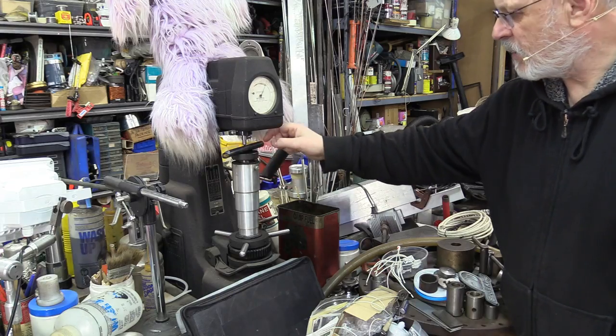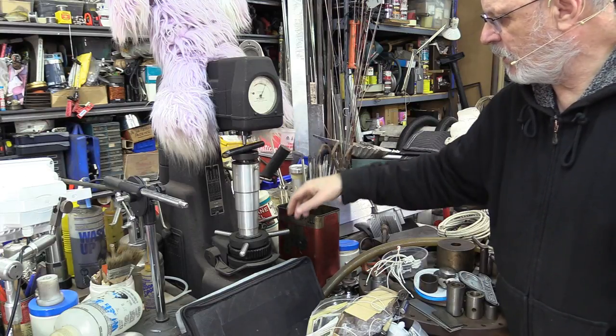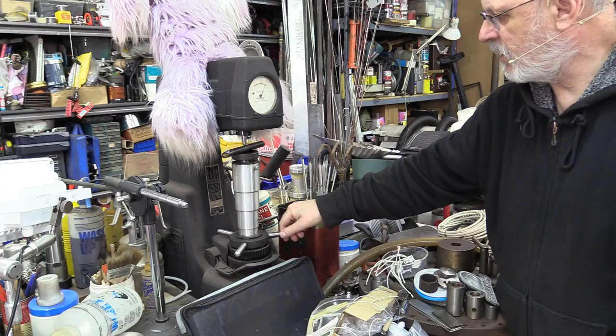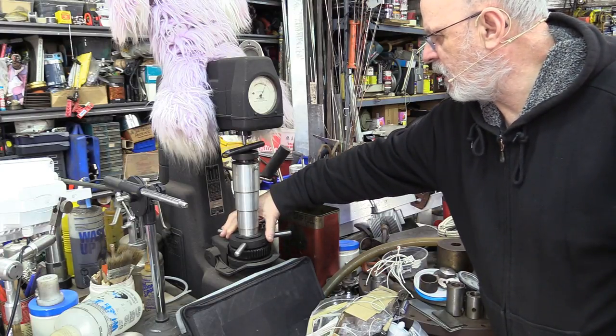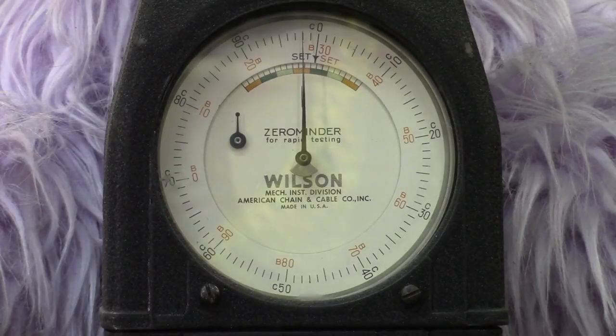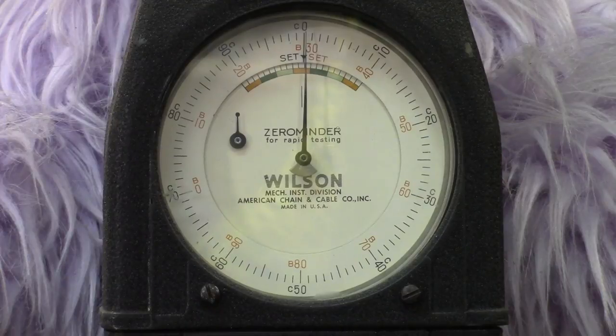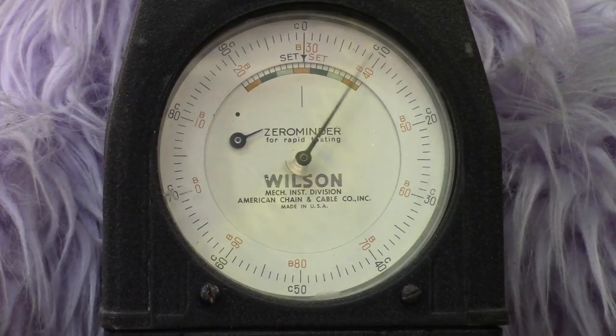No real serious test would be complete without testing the hardness of the bars, the holders. Let's do the test on the Rockwell C scale and see what the result will be. So let's bring this right up there. There we go. Let's make the calibration. So we're within the range. We release.